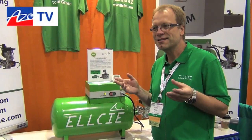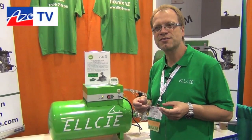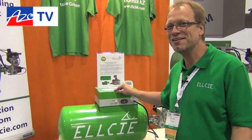Because normally when you are operating an electron microscope, you have to have a roughing pump — a backing pump to back up your turbo pump. The vacuum level necessary in this case is just a very small amount, and we use this tank, this smart tank, as a vacuum storage device. So in this case you can switch off your noisy rotary pump and enjoy working with your microscope.